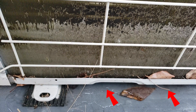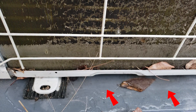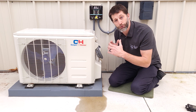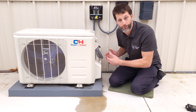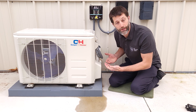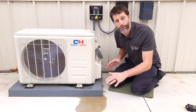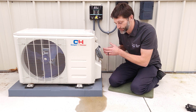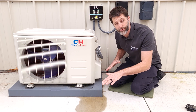That may occur if there's a long run time for the system — it may turn on for say five minutes during that long run time. It's going to also turn on during defrost if the outdoor temperature is low enough for that water to refreeze. The base pan heater is going to keep it in liquid form until it drains away, and it may also stay on after defrost is done just to make sure the liquid has time to drain away from the system.